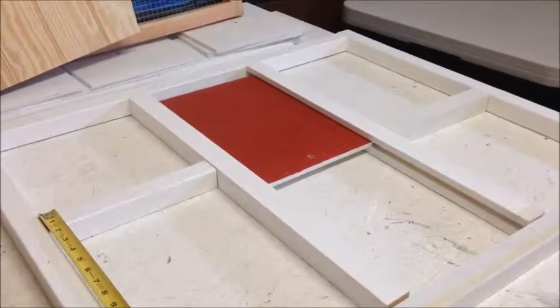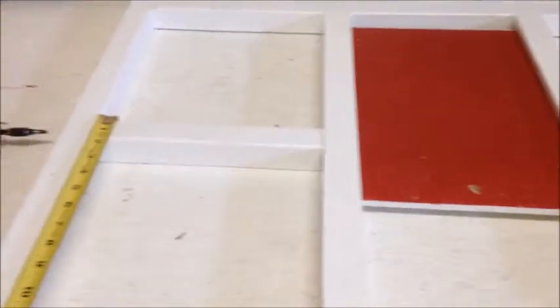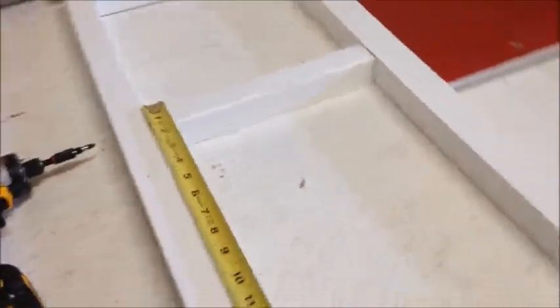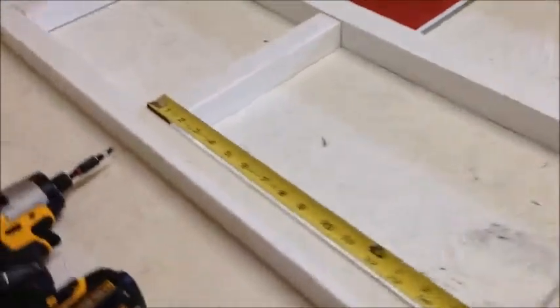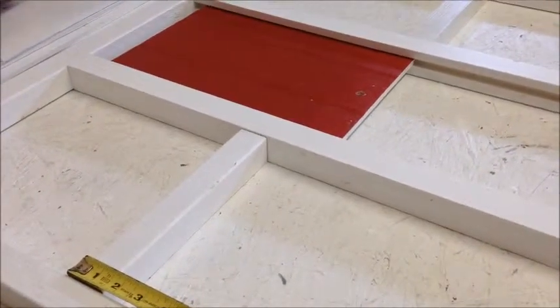Be sure to slide the door into the door jamb before you secure the other two ends. Then, taking that 10.25 inch piece, put it at a distance of 18 inches and screw only on one side. You don't need to mess with screwing it on the door side.